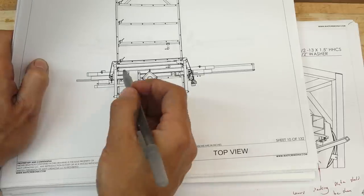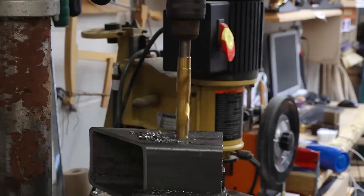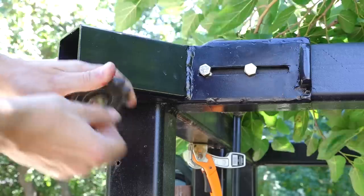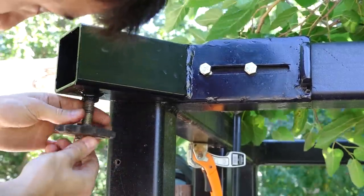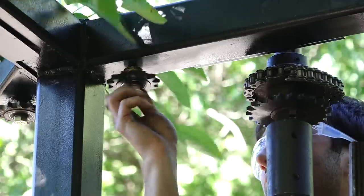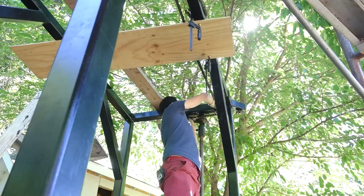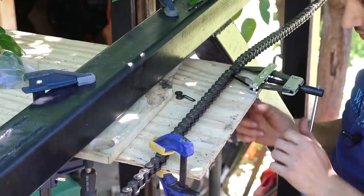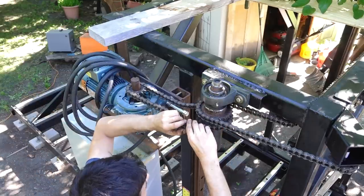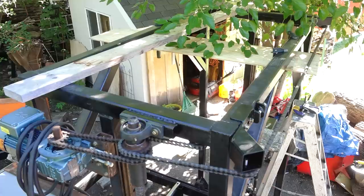Next up is the proper chain linkage. The chain will follow along the front so the motor can be lifted past the top of the carriage. I have four idler sprockets to install — the first two are on mounts with one adjustable for tensioning, bolted to the upper corners of the carriage. The movable one also gets a piece of angle nearby for the tensioning screw. The two other sprockets get attached to the underside of the carriage with tapped holes and bolts. With all those sprockets installed, I start adding the roller chain, snaking it through all those sprockets. I cut the chain, made the final connection, and gave the tensioner a try. Then I connect the motor to the driven sprocket and tension its chain by moving the motor on its mounting plate, and flip it on to watch the chain travel around the sprockets — it's kind of mesmerizing.